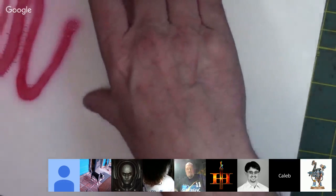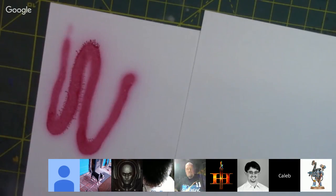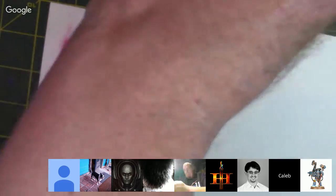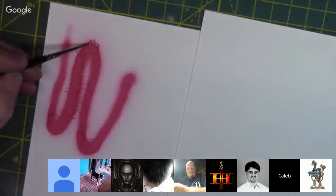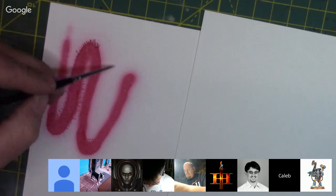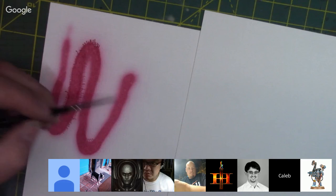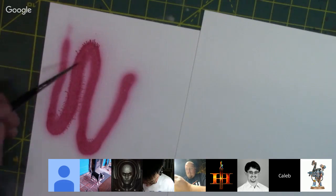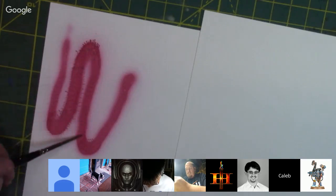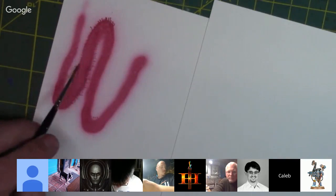You're going to notice when I'm spraying those lines that I've got a couple of issues going on. One, I've got this spidering right here, where my paint is getting legs and running out. You'll also notice there's a really heavy overspray, so where my line is, I have a very big fade of paint around it. And the center of this line is a lot thinner than the edges. I start to get these really dark edges on the sides.